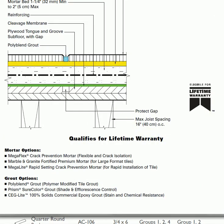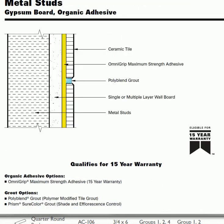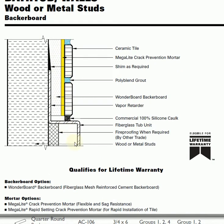And here's just yet another version or flavor of this kind of installation. If we look at walls, here is a schematic of just the tile with a layer of thin set over. It doesn't say sheetrock, but that's kind of what it's showing here. In wet areas, inside of a tub or shower, a lot of states have adopted a code that says you can't use what we used to use, called green board, but now it has to be at least cementitious backer.